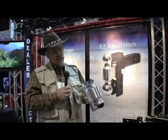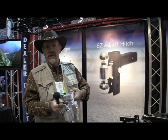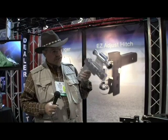What's new with this: it now has a bigger gusset on the shank. It has a cap on it — you don't have to grease it, so you get rid of getting grease on your pant legs and everywhere else. It's a nice thing to not have to grease your hitch. It's a very adjustable hitch, and a light hitch because it is aluminum.